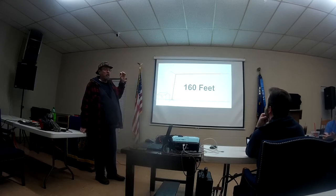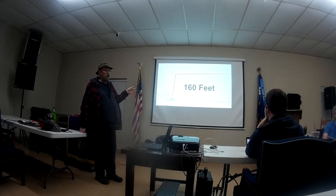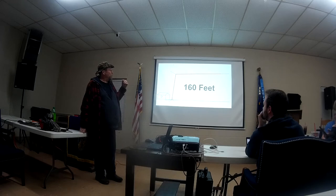On 10 meters you really can't tell, because WA2-0-UV uses the horizontal beam and he's on the vertical. I can completely lose the signal on my 40-meter vertical, switch over to the wire I've got, and it's S6, S7. So 10 meters is the whole story. The more horizontal length you have will also make it quieter.